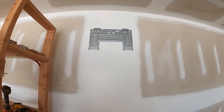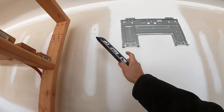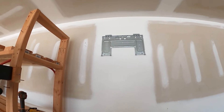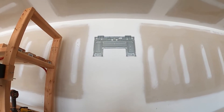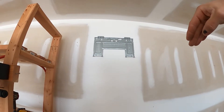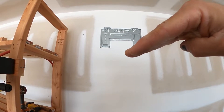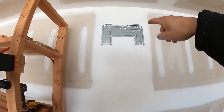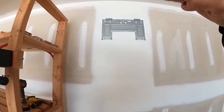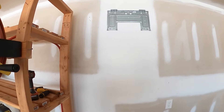I've read ahead in the directions and the next step is to drill the drain hole - I'm gonna put it somewhere right in here. When I say drain hole I mean the entire hole that everything passes through, and I'm referring to it as a drain hole because the drain pipe and hose are going through it. You don't want it level - you want a downward slope so when your condensation drains it goes down and out instead of just sitting there, so I'll drill it at a downward angle.